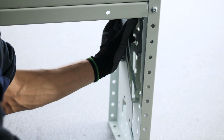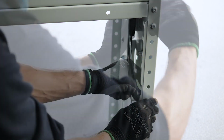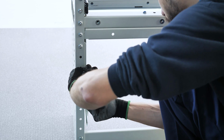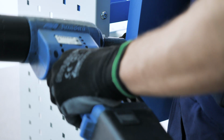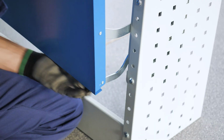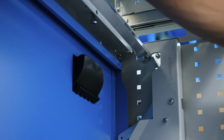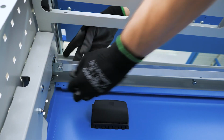This project also includes a door for the floor-level compartment. To fit it, fix the countersides with parallelogram action opening mechanisms to the side panels first. Then, rivet the door to them. Fix the synchronizing profile to the countersides from inside the structure. Then, check the correct functioning of the door.